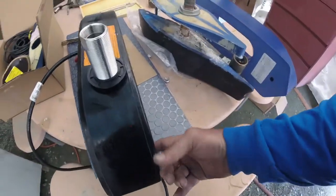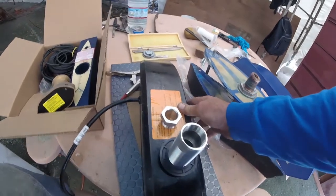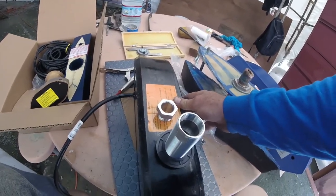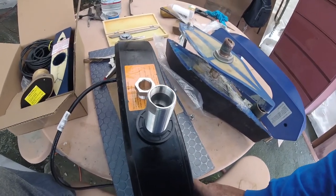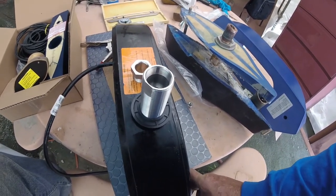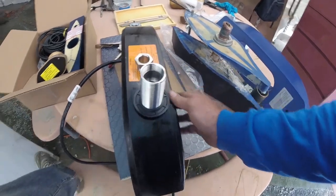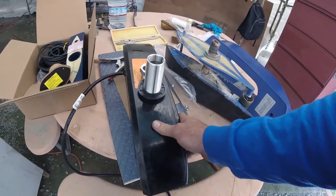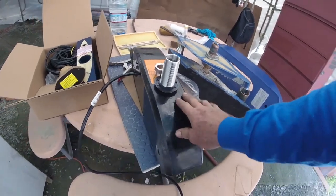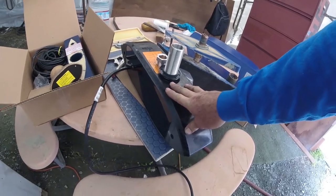It takes all of its mechanical properties from the two big, huge bolts, which, yes, they can be sheared off. You hit a big old log head up in Seattle, or you come down on a whale or whatever, yeah, you could knock this thing off. So there is always a chance of sinking on any transducer that you put in, especially one that's this big and sticks down. Also, this is limited to 25 knots or less.